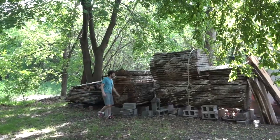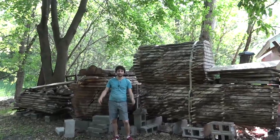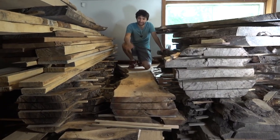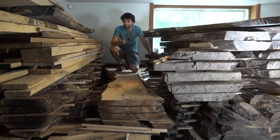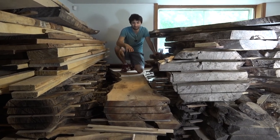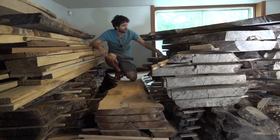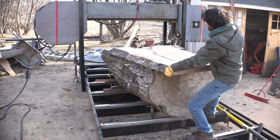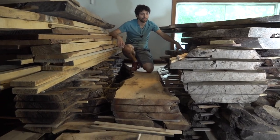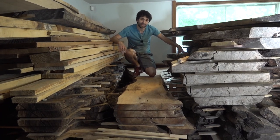That's the outdoor drying stacks, where the big stuff goes to dump moisture before going into the drying room in the house to reach indoor equilibrium — which we consider fully dry. Currently in the drying room I have slabs and boards from my 'how to turn a log into lumber' series — the walnut and cherry slabs up top, and walnut and cherry boards on the bottom. Over here on the right I have a couple of silver maple crotches: the first one I cut when I built my bandsaw mill, and the last of the large logs I cut. These have been in here drying about a month and are sitting at about 10%, so probably another two months until mid to late July.